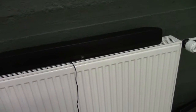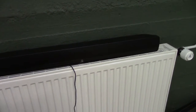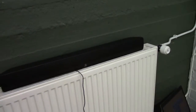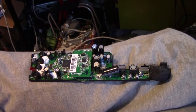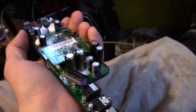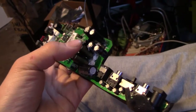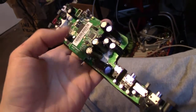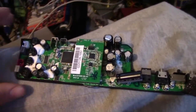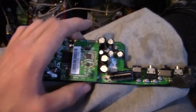It was very obvious the last time it got issues because it just would not ever turn on again. It would just sit there, flash its LEDs briefly and not really do anything. So we'll see. I just brought it home and started replacing caps on it, mindlessly going by the labels on the caps rather than measuring around, and I started getting a bit annoyed at all the high voltage caps they've used, because all the large electrolytics are 25 volt rated except for one or two, and I just noticed that that's entirely pointless because I just hooked it up and it goes like this.